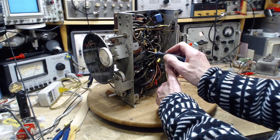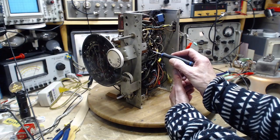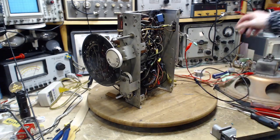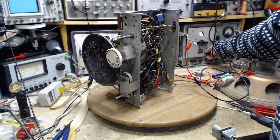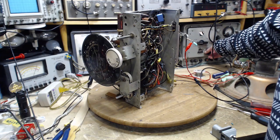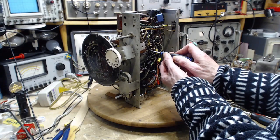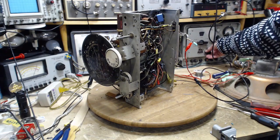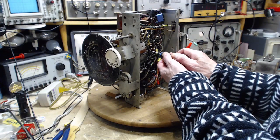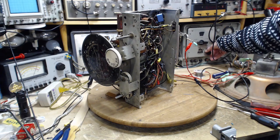A long ways to go to get to 16. Oh, this is way loose. Wow, that was really loose. Way out. Okay, let's see where we are now. Oop, wrong way. Okay, we're at 17.3. I'll put this at 16.7. See when we go by it, because the capacitor is tightening up. Never went past it. Where are we now? Okay, let's see if we can tighten her up further. Yep, past it. Almost 16 exactly now. Notice the radio got quieter and quieter.